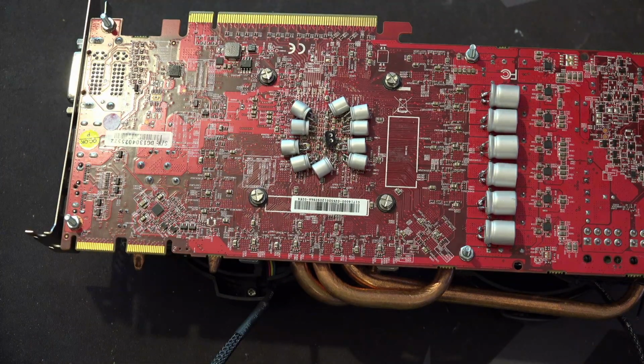If the temperature was any higher and the run crashed at a lower frequency, the whole test is invalid. It potentially crashed because your temperature's gone up, not necessarily because of whatever I did. So the testing wasn't super rigorous because it's not a full run of Firestrike or anything like that, but it's still a pretty good indicator of basic GPU core stability and if there were any benefits.